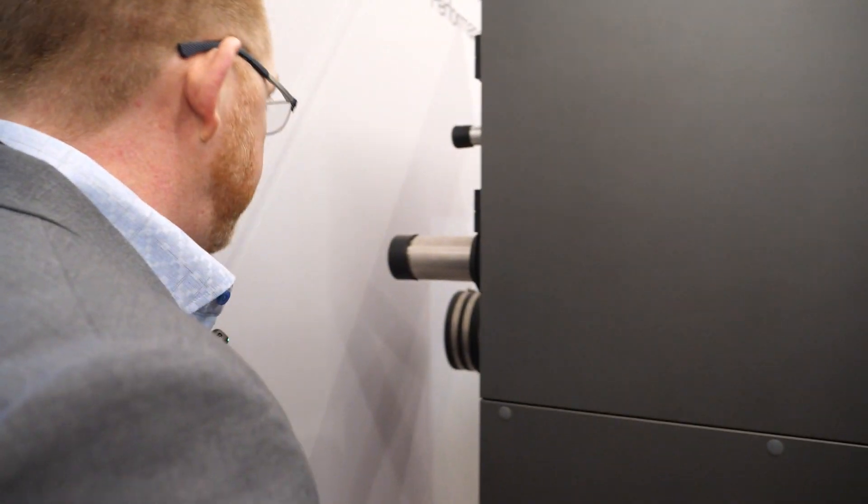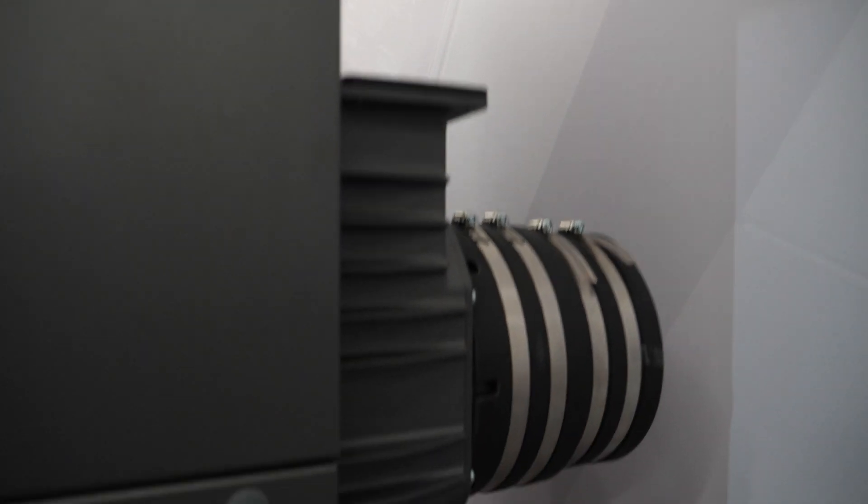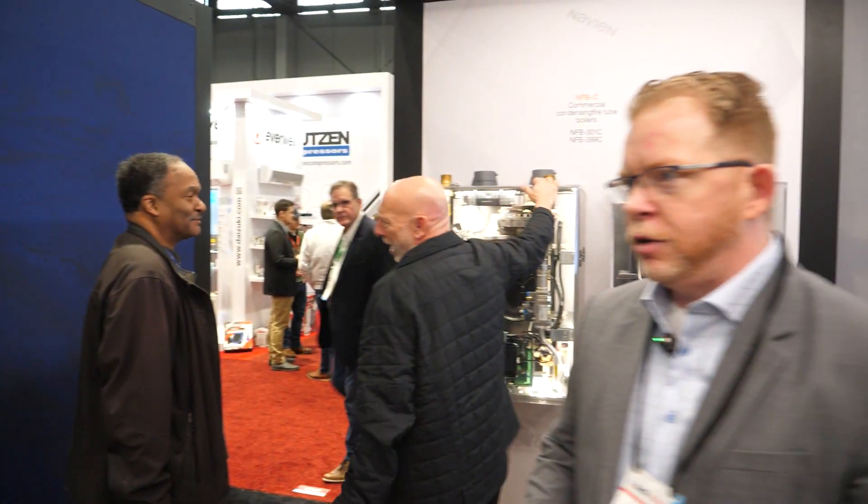Basic connections on the bottom — water in, water out, your exhaust and air intake. This is still a prototype, so some of this might change. You want to make sure you can pick it up with a pallet jack or a forklift, so we actually have an additional plate at the front to hide that and give it a nice finished look. You can actually pick it up with a forklift and move it around. I'm assuming Navien designed this to fit through a mechanical room door — we've got to make sure it's less than 36 inches to go in.